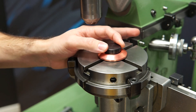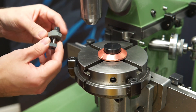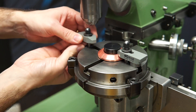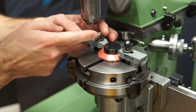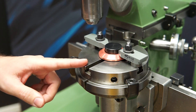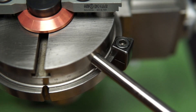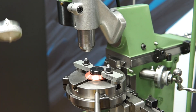It's not perfect but it will help me center it a lot. Next step is to fasten everything. I don't have a machinist jack so I just use some round stock. To turn the table I need a handle — I didn't get one with the machine so I made one, nothing special. It goes into the hole here. Now I can use it to turn, and to make sure it is centered I'm going to use a dial indicator.